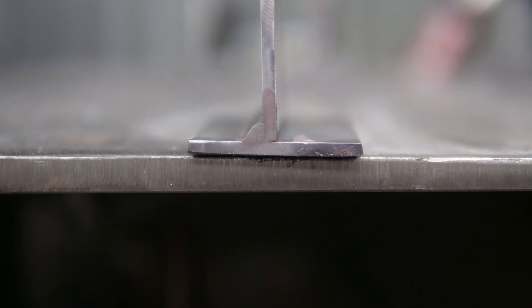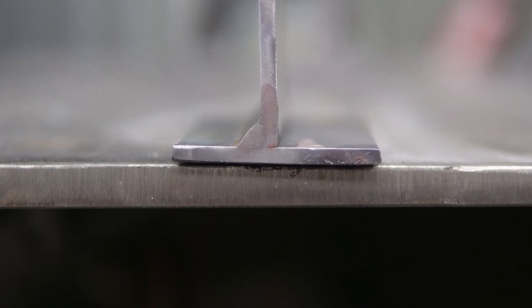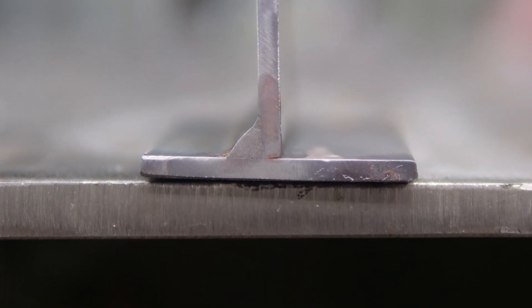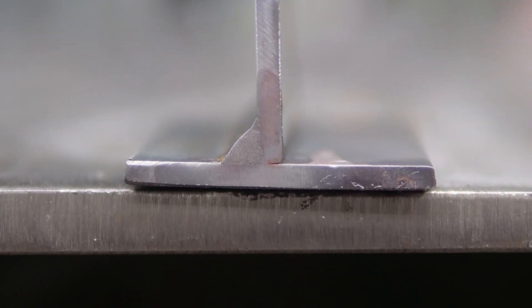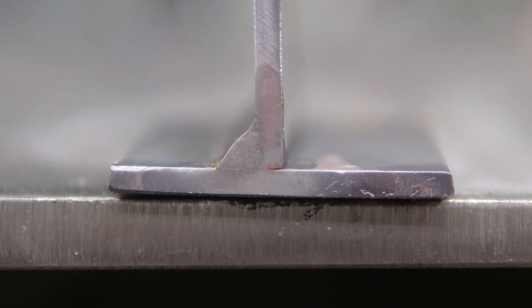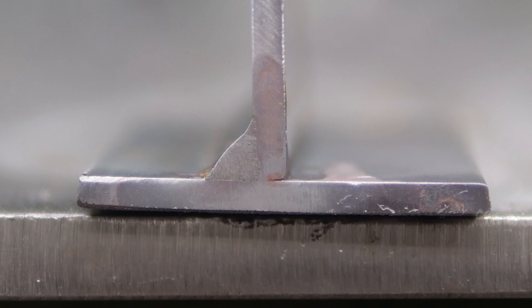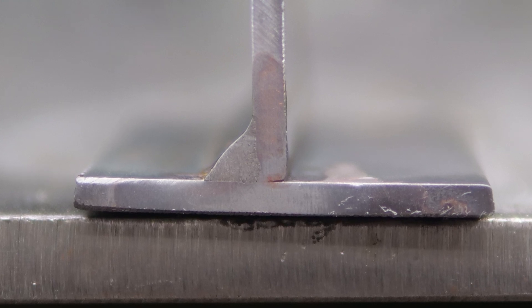Here is the face of the L56. You can see it's got good wetting at the toes and it's a decent looking weld. Flipping over to the cross section of this L56, we can see very decent penetration. I did this with the GMAW-P, or pulse process, so you're going to get some great penetration. It's got a good weld nugget, we've got some root penetration — everything looks good with this L56.